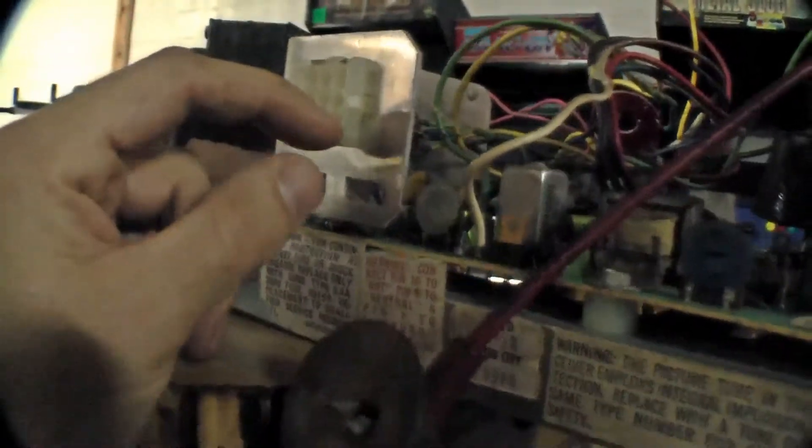Inside the composite cable it should be a white and a black wire. Your white is going to be your video signal and the black is going to be the ground. So when you take the yellow connector going into the monitor and snip one end, then peel back the casing with your wire strippers, you'll find those two wires. Just splice the two wires from the chassis into those, plug your TV in like normal, and it should work.